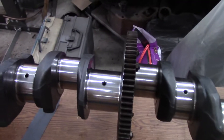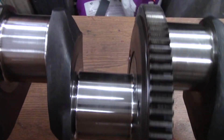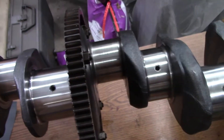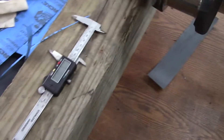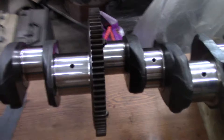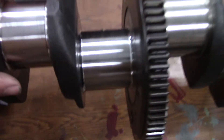So I cleaned up this crankshaft - we scraped it off with a razor, then went to 320 grit and just polished it off. I'm thinking it looks pretty good. I just went over the whole thing with this digital micrometer caliper and everything's coming up pretty specy. I'd like to have a micrometer - not the caliper style, the micrometer style - to really check it. But I think we're gonna Plastigauge everything. I think we're pretty close to the next step being getting some bearings, set it in there and Plastigauge it.